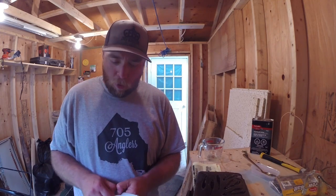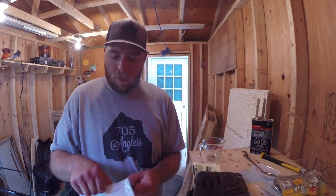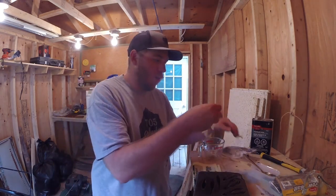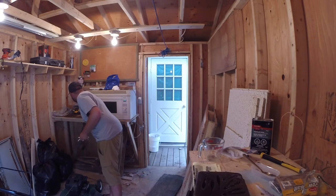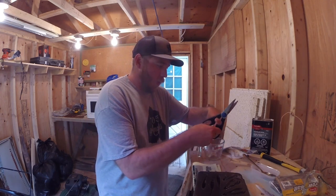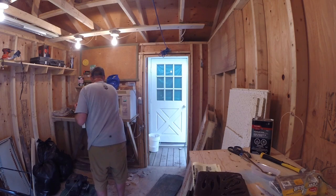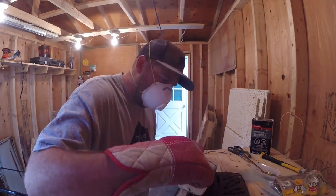Aside from saving your own plastic to use, one of the things I do too is look for bargain bin stuff. These are pure white Craws — like a two dollar bargain bin. I'm not going to use the pure white Craw up here, but for two bucks I can make fifteen bucks worth of swim baits. I'm going to get these out and snip them up a little bit again just so it melts quicker. Nice smooth consistency there — you can tell there's not much salt in these ones.